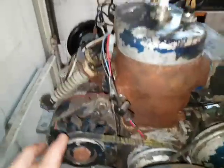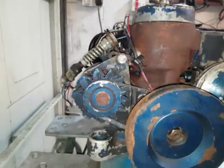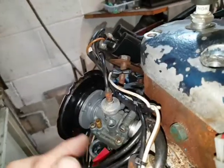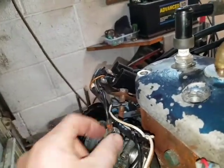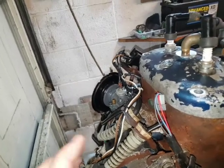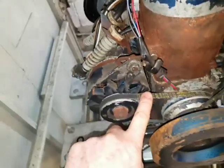So this is also something you wouldn't need to fiddle with much, apart from adjusting the belt tension, but it's right in the way of getting down the back here to the carburetor. So if you want to clean the carburetor out, because you may have ingested some rust from your fuel tank or something in there, that's very difficult. You'd have to undo the neck screw, pull it out, disconnect the throttle screw, and then you could put it on the chart table or whatever to clean it out. But it might be that they could have put this on the front of the engine instead. Would have been slightly noisier for the occupants, but it would have been a lot easier to service the carb. So I think the reason was simply they had the pulley at the front.